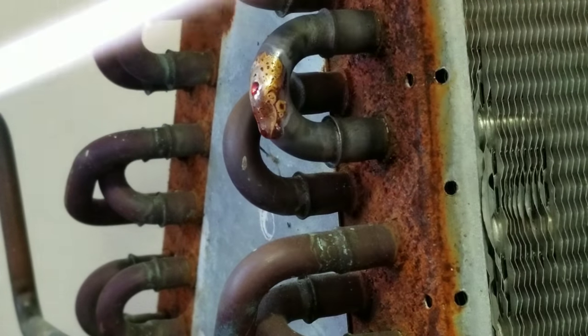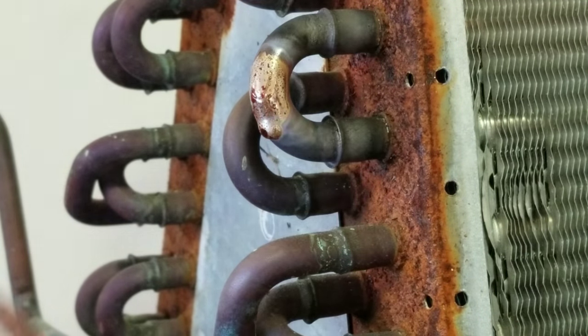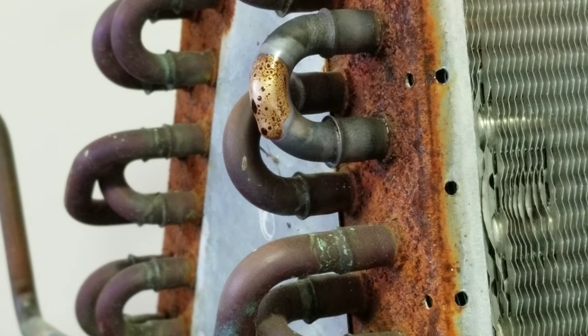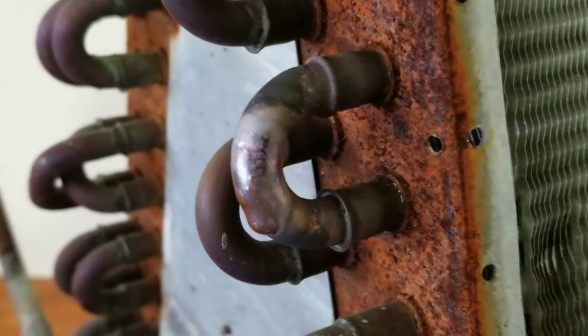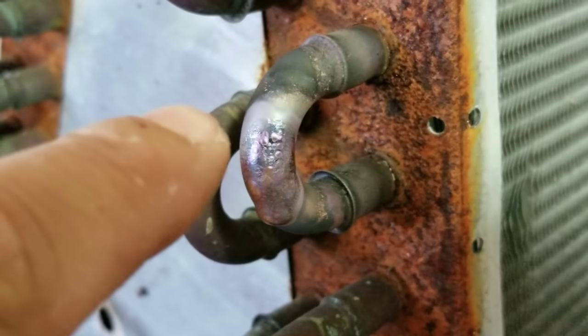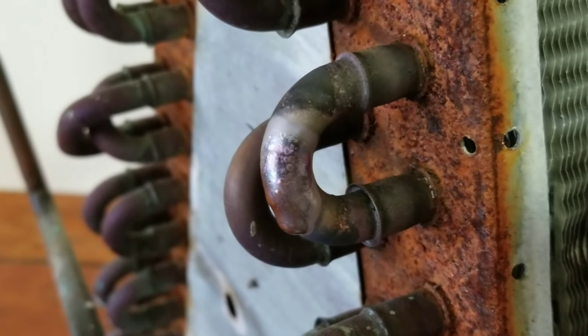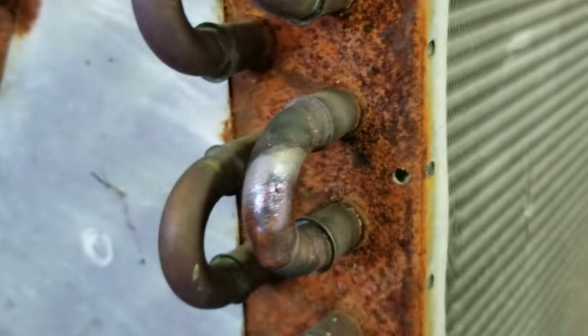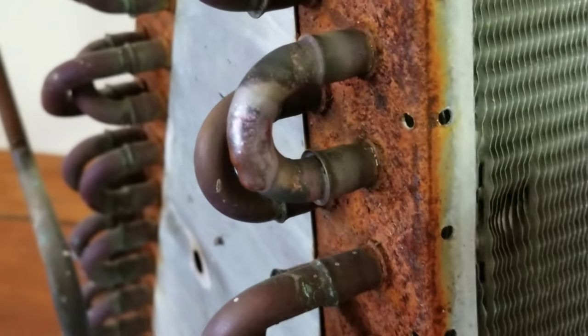You can see I'm just bringing the heat in quickly and then removing it and letting things cool down for a second. And that's pretty much it — there's not a whole lot to it. Those are pretty simple repairs. There's the finished product. Not the prettiest thing in the world, but pretty clean. I like to try to make the braze blend into the pipe rather than having a thick scab on top of it — this tends to hold a lot better, really bonded with the copper. That's a relatively simple fix.